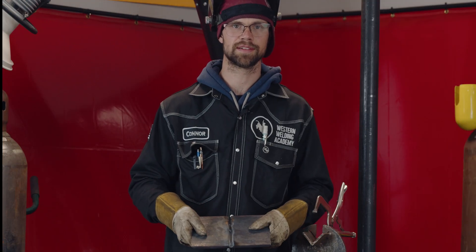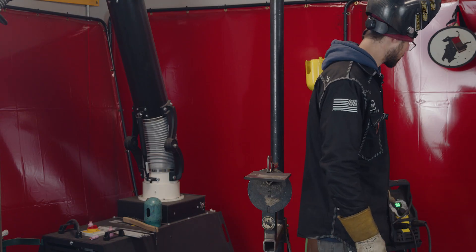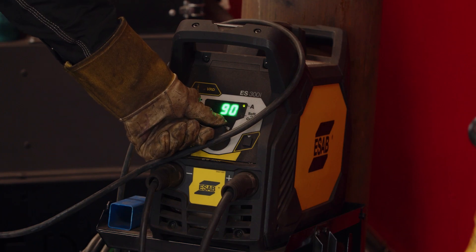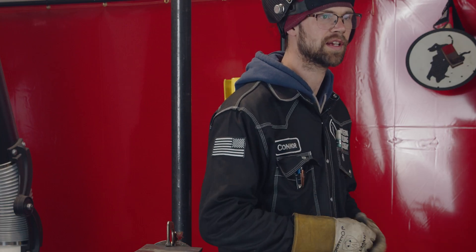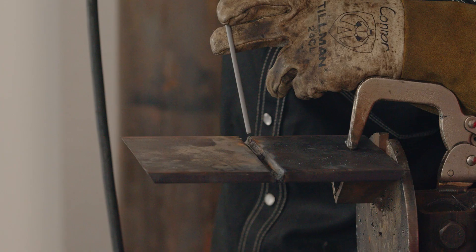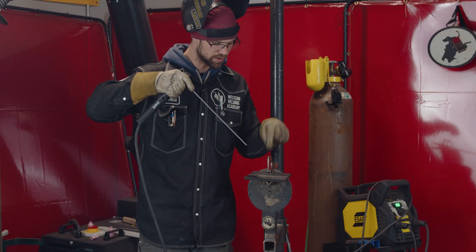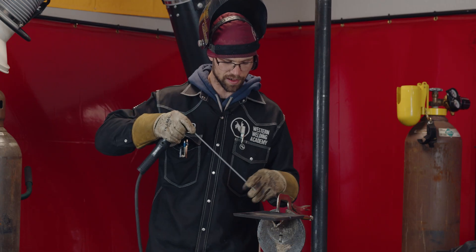Now that we're done with step two, on to step three: weld it. On our ESAB ES 300i, I like to set it to 90 amps for the root repair. Make sure that we're on the 6010 setting — that's going to be a lot more crisp than the other settings and it's going to make sure that we get all the way through and get good penetration to seal up that root. For the repair I'm going to use an eighth-inch 6010. I'm going to start out with a really direct angle to make sure I get through right away, and then if it gets a big keyhole I'm going to lay that angle back and pick up speed.